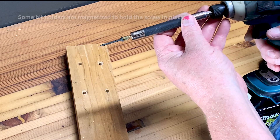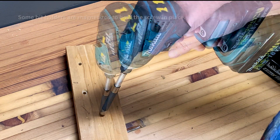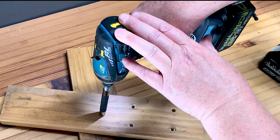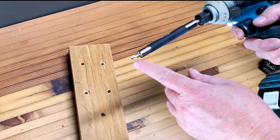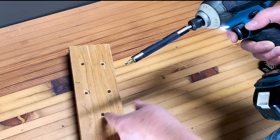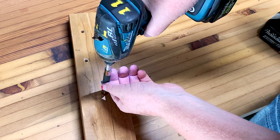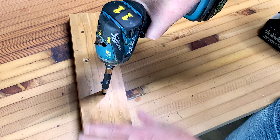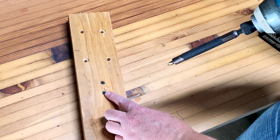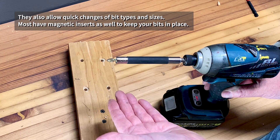The screw goes in and is held in by the bit. You can slide this all the way forward with a little tip pointing out. You put it exactly where you want it. The theory is that you push down and it stops, but I find it's easy to overdrive and over-sink them. So if you're using this adapter, you need to use it to get started on the screw. But then once you're nice and stable, pull this back so that you can see where it goes, and you can control it and only get it just as far as you want. This is an added feature to help you control your driving and make it easier so you don't smash your fingers.